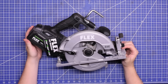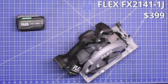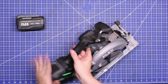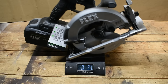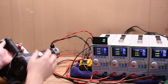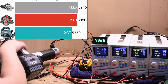Coming up we'll max this thing out on the dyno, but let me introduce another serious contender: the Flex FX 2141-1J. Flex is another brand offering pouch cell batteries, which seem to always make more power — and unsurprisingly, we think that's a cool thing. The 1J Flex kit comes with a 10 amp hour stacked lithium battery, known to be a bit of a monster and enough to hop up a lot of 18 volt tools — and kill at least one of them for good. RIP Ingersoll Rand. While the M18 was heavy, the Flex is even more so at 12.3 pounds. Speed under load: 5,945 RPM — basically unfazed between free speed and under a common load. Nice.